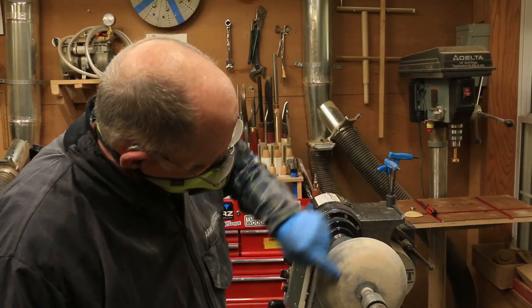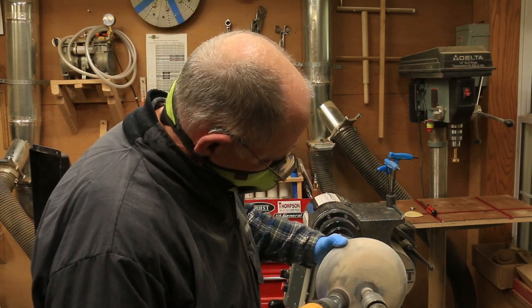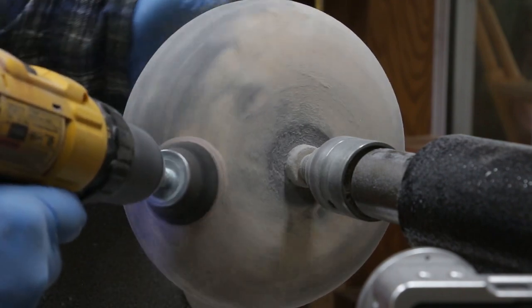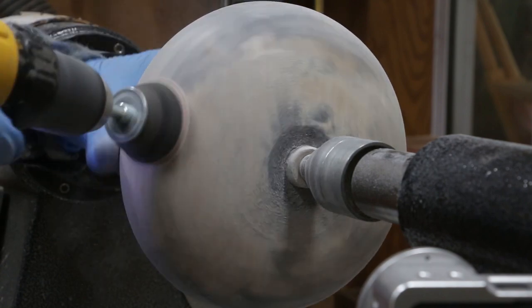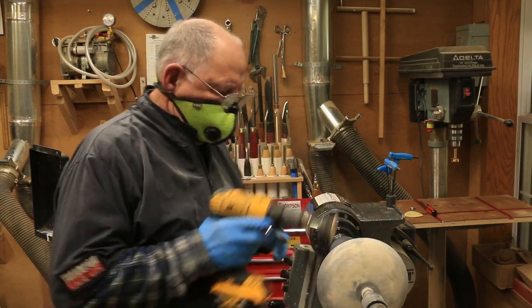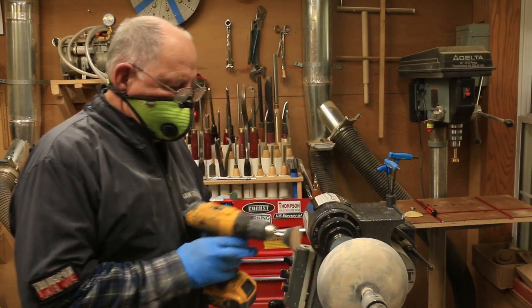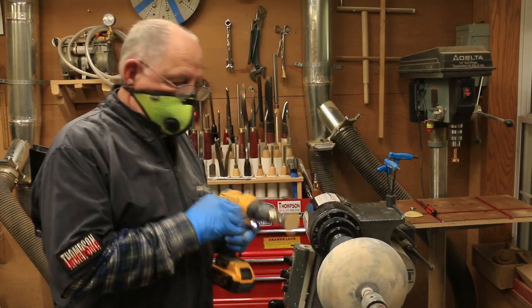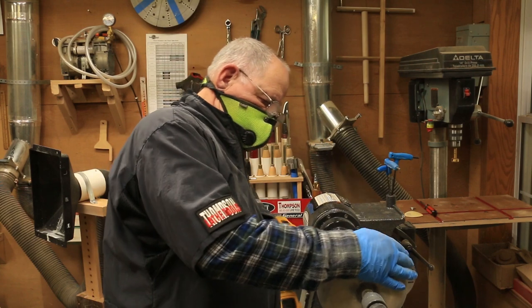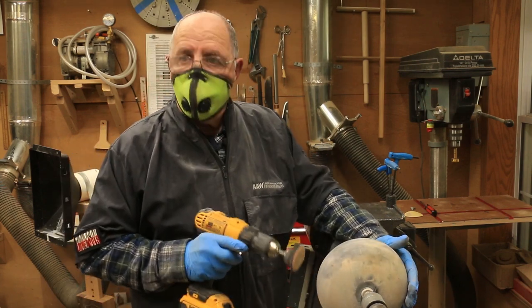I'm not going to get rid of it all the way, but I've got a little streak here that would just be unattractive, so I'll go back and try to get rid of some of that because it would look too much like a tool mark. You're going to take off almost all of it, and the reason is what is left embedded in those figured grains is going to pop more and hold better than the grain that's more straight.